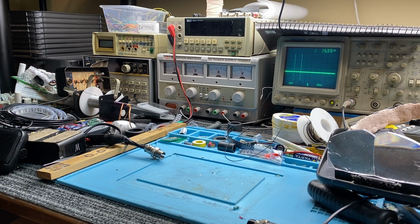But remember, if you're going to do anything on those detectors, you'll probably void your warranty. No, but you might get a better detector. Bit of hot melt glue is probably the safest bet around that area, because they are enclosed inductors. I don't think you're going to do anything. You're not going to change the inductance value or anything like that, and it's not going to add any significant capacitance to the circuit or anything. It's just probably a non-event, and maybe clean it up a bit more.